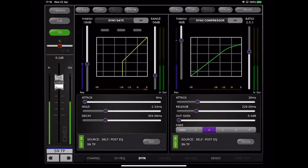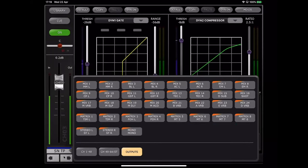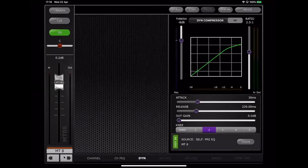To navigate directly to an output channel without going back to the mixer view: press and hold on the arrow keys and you'll get a grid of all the channels on the console. In this case, I can go straight to Matrix 8 — no need to return to the main view. That's simply a press and hold on the arrow buttons.